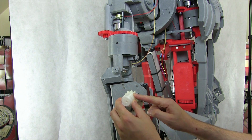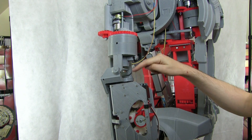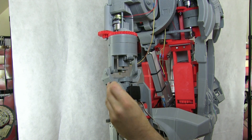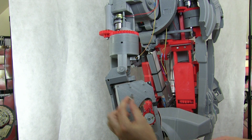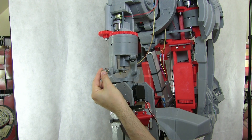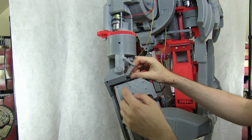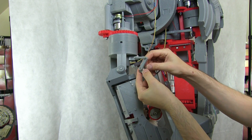I've reprinted and put the opposite worm gear on now. All of these face the other way, so now the shaft on the pulley means the string can come out direct centre. We need to put some feedback on the joint so when we bend the elbow we get feedback. We've already got a feedback point on the rotational part — a little potentiometer that gives the position — and I need to do that on the elbow as well. The original elbow axis was narrow but now putting the pot on the outside would make the elbow really wide. So I've made this little gadget — a little bendy arm that sits in there and bridges across the joint, so as the joint bends, this bends too.